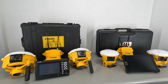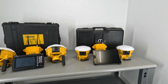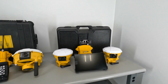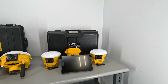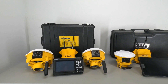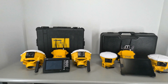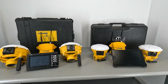As far as which kit is being wired from the factory, they both kind of are. CAT machines specifically can be wired from the factory to be plug and play for Trimble — both Earthworks and GCS900. Generally, CAT dozers newer than around the 2018 mark are typically wired for Earthworks systems, while anything 2018 and older are typically wired for GCS900 systems. Wiring kits are available for most brands of machines, including John Deere, Komatsu, etc., and that's available for both.